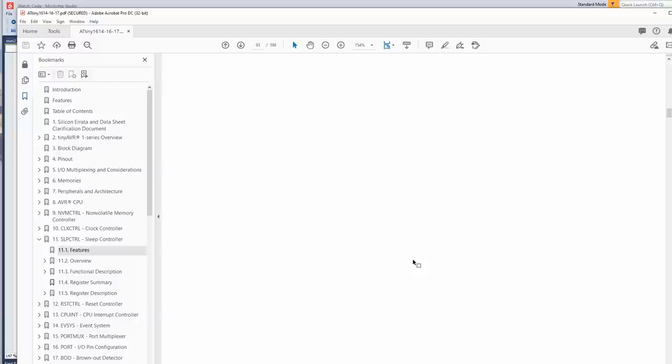So we'll put it to sleep right after it draws a Nintendo graphic, even though the Nintendo graphic takes a while to draw. Maybe that's not the best time to do it. Oh, I know what we can do. We can hook up the backlight. Yeah, so we'll turn the backlight on for like 200 milliseconds, and then we'll put it back to sleep. Yeah, that way we can see something happen, and then we should be able to see the change on the meter.